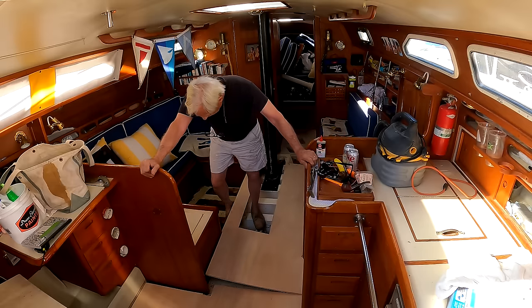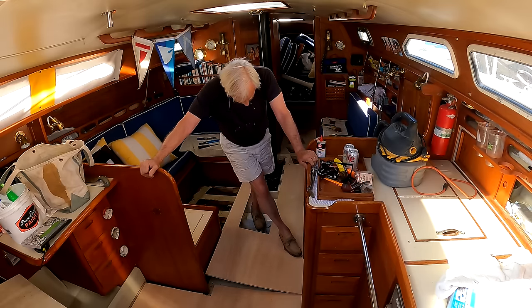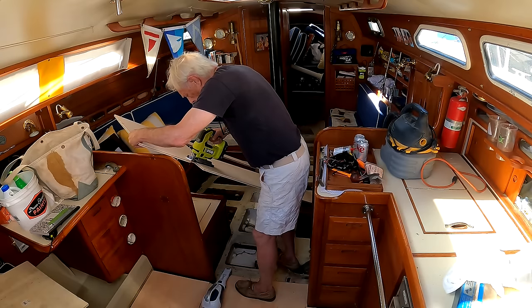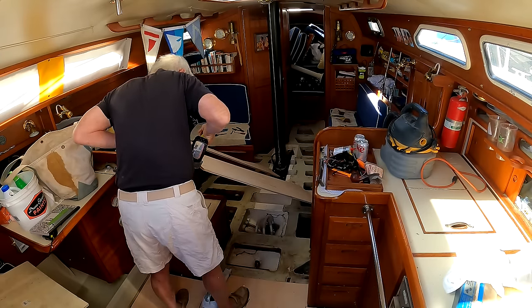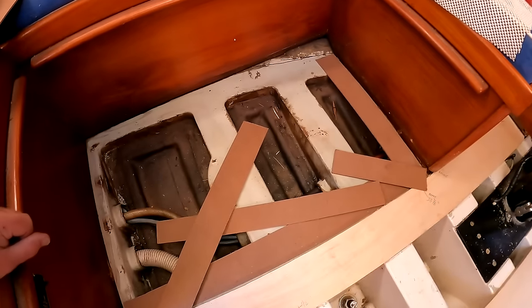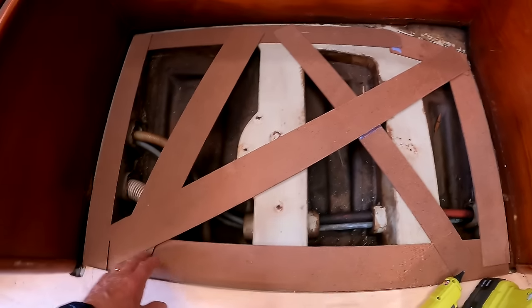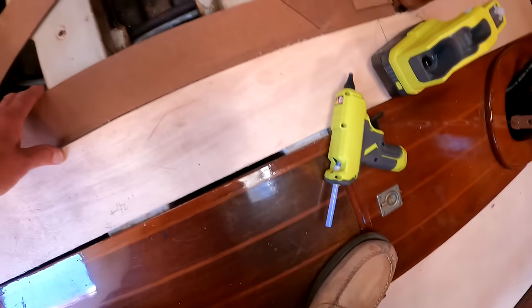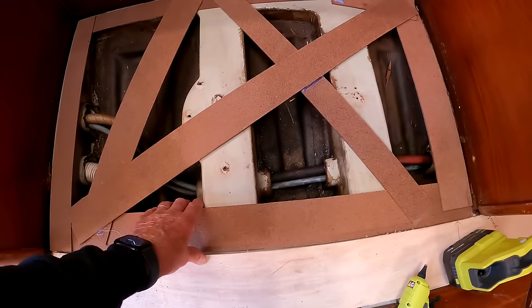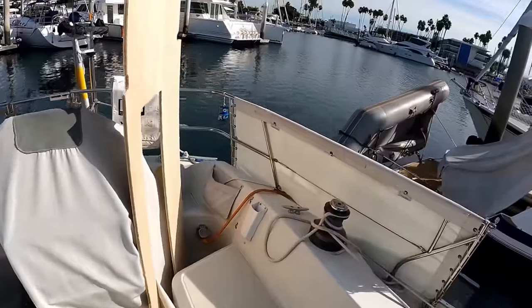The pattern from my ragged old half-destroyed floorboard was so beat up that some of the measurements were guesswork. I have seen the strip method and I thought I would try it for this last piece. These templates are easy to make and they can be very accurate. Then it's just an easy matter to use the pattern to cut the plywood.